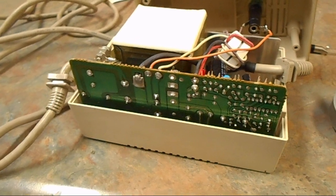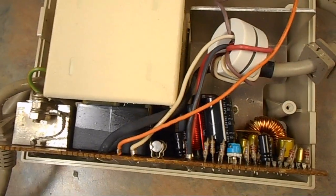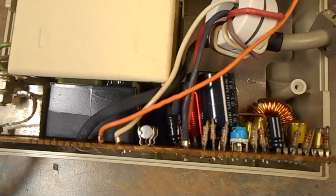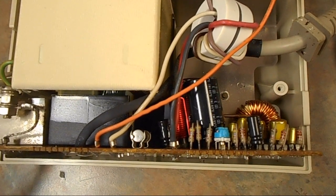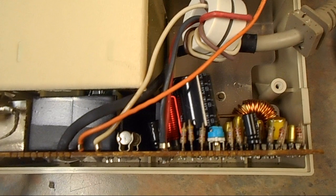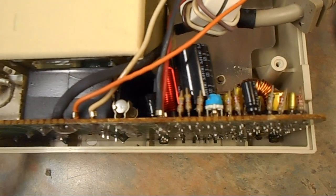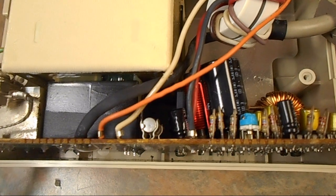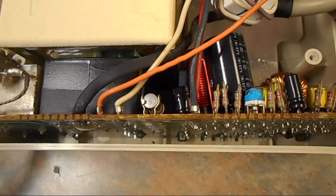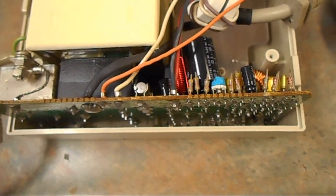So anyhow, I was kind of glad that I looked at this thing, and oh my golly, it's got a circuit board and a transformer. I don't have to go through a sealed plastic thing or toss this thing out and go buy a new one. All I've got to do is hopefully just change the fuse, and that'll be it. So the next thing I'll be doing is putting the Commodore 128 back together, and then I'll finish working on this, put the fuse in, check it out and see if we're getting 9 volts out, and make sure it doesn't blow again for some reason.